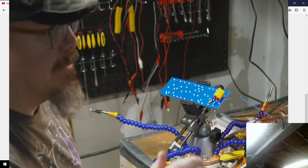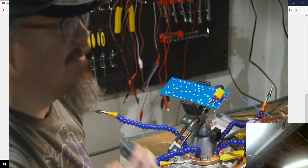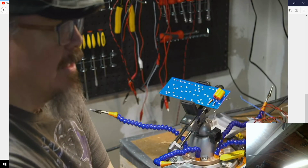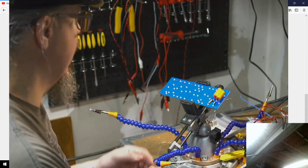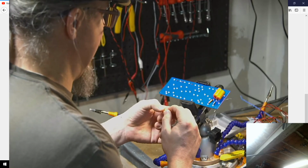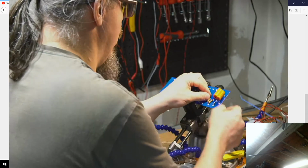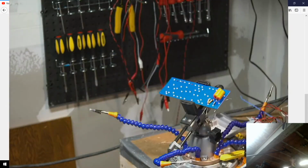But then there's also a modification to this amp that you can do, that same exact layout, but they changed it to a later version that was modified. This same amp was tweaked by Dumble later to hit what I think they call the high plate classic, where the plate resistors went from 100K up to 220K, and there's a couple other tweaks as well in the circuit that make it a little bit different. But I'm intentionally creating that first one because I'm seeking that particular sound myself. I won't be necessarily jamming with it a lot, but that was the reason that I'm curious about learning it. So hope that answers your question. And just let me know if that's in the Slack or in the chat.